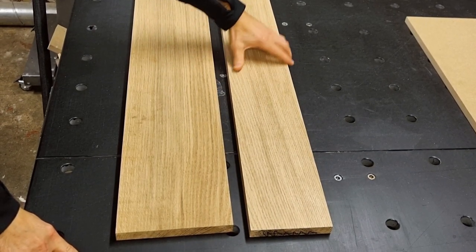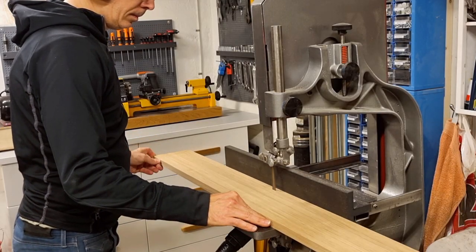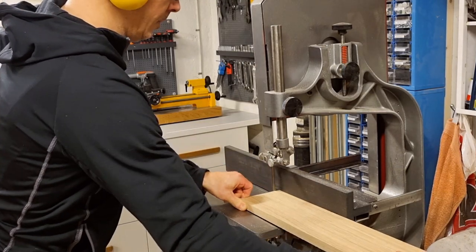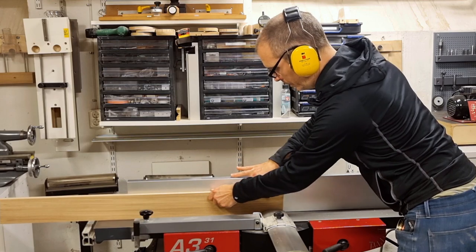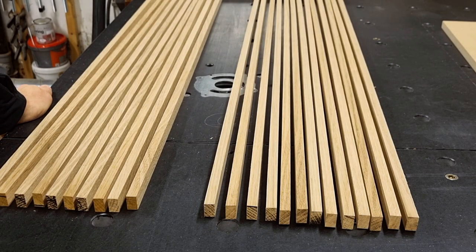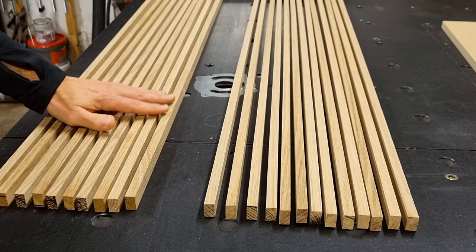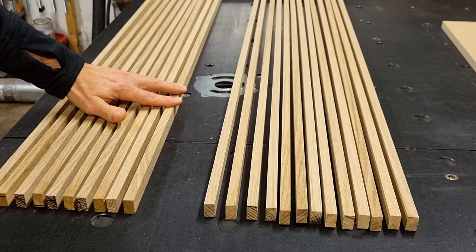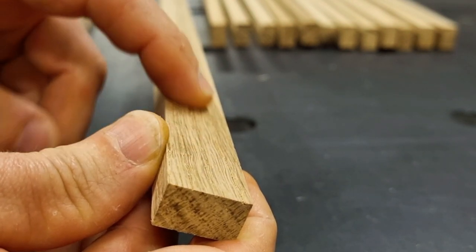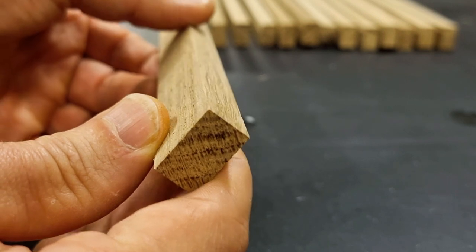The outer edges of my two boards are jointed, flat, and perpendicular to the faces. I then go to the bandsaw and cut one edge banding from each side of my jointed and planed boards, then head back to the jointer and re-joint those edges. I repeat this process until I have enough edge bandings plus a few extra. Don't worry if the parts are slightly warped at this stage — it won't be a problem when you glue them onto the base. One side on all my parts will have a planed surface and the other a bandsaw surface, and they will all be about 11 millimeters thick.